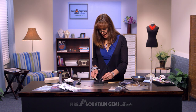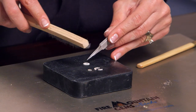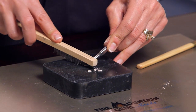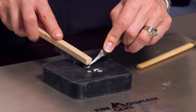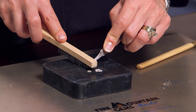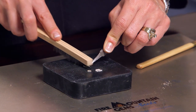First we're going to do it with a very stiff wire brush. You want to have a tool in there when you work — don't put your finger down when working with this type of brush because you can definitely hurt yourself; the bristles are very sharp. When you do the wire brushing it will start making it look more silver because you're flattening those silver molecules, and it's going to have a brushed metal look.